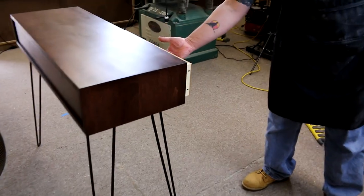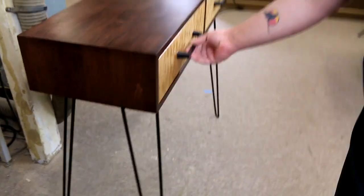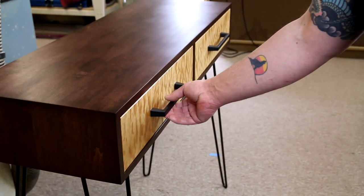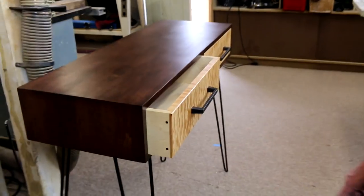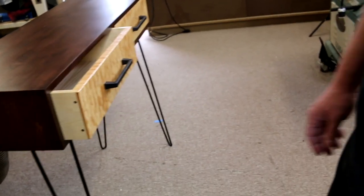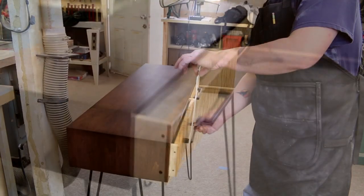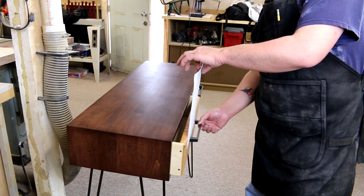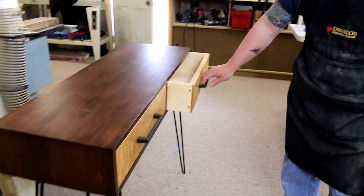Open the drawer. These drawers are almost piston fit. You can actually feel the air, the suction behind the drawer when you close it. The action on them is beautiful. That's the only thing that's good about hand fitting a drawer with a plane. What if you were to get a piece of paper, put it in front, close it, and let the paper... Well, we could try that. You actually see the force. Yeah, see that? There you go. Of the air that's coming out. That's nice. Nice fit. Both drawers same way.